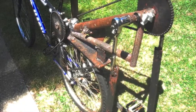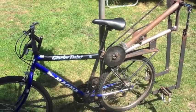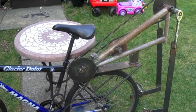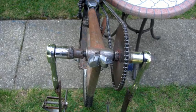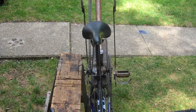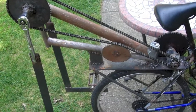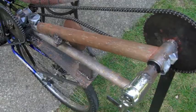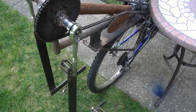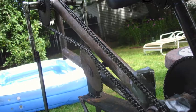It has several problems. Every time I tried to ride it, it felt like I was bending the frame. It is like a regular bike, but also very different. The bike works by having extended crank arms in combination with a series of gears which make the gearing much higher. The basic concept is that when you take the force of pressing down on both levers with both legs at the same time, combined with the force created by the levers themselves, that gives you a lot of force to move the high gearing at a fast rate.